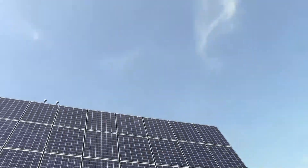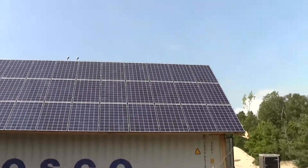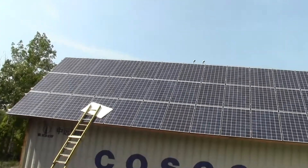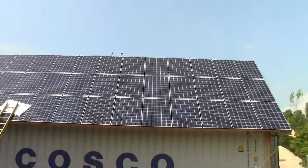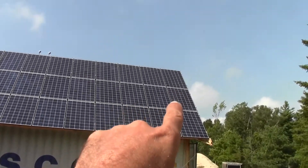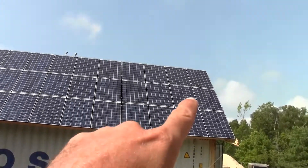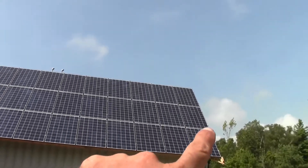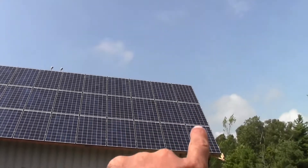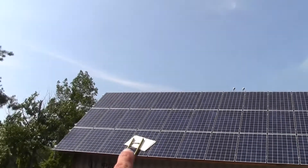As you can see, we have our solar panels on now. What we have is 39 panels in total, so it's pretty much a 10,000 watt system. All 39 panels are 255 watt panels, about 36 volts — they're about 37.7 volts open circuit, but about 36 when everything's connected. Each row of three panels is wired in series, so it's about 102 volts per string. And then there are 13 strings all the way across.